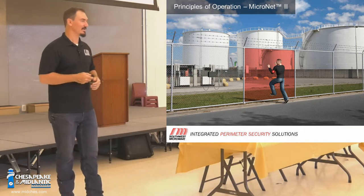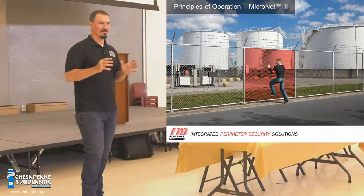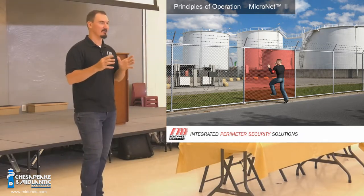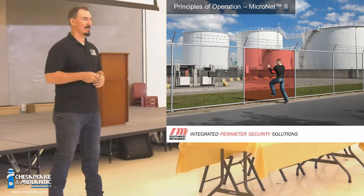That's one of the great things — and challenges — about dealing with RF and leaky coax: each interaction is a little bit different. Each scenario where the cable crosses wires or pipes in the ground, or where the cables go near fences, is a unique scenario and each takes a little bit of attention to get figured out and nailed down.